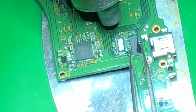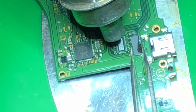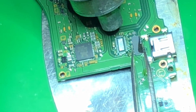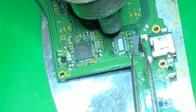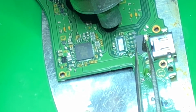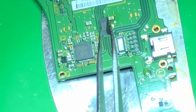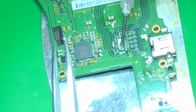so I don't feel a need to reinvent the wheel here and wick all this off. Put leaded solder on there. It's probably best to avoid leaded solder altogether. A lot of times if I can just reflow a part and leave the lead-free solder on the board, that's exactly what I want to do. I know it's a little hotter, but that doesn't hurt anything, as long as you're controlling your temperatures carefully. But it's definitely true that leaded solder is easier to work with because you've got a 100-degree window of lower temperatures.